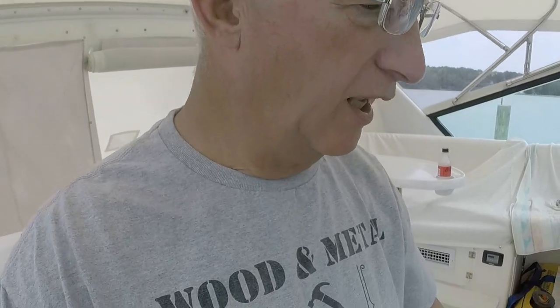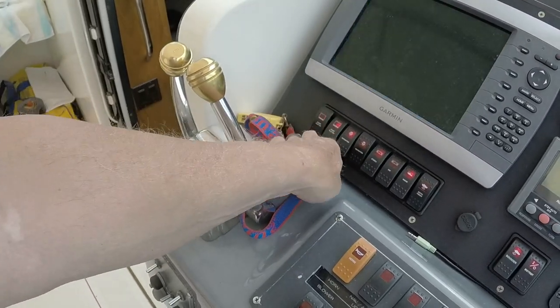The task right now is to go ahead and start working on installing the new XM radio cabling for the new receiver. So I'll have that all in place, so when I go to replace the MFDs, it'll be a quick switch out. I just unplug one, plug the other one in. I've got another device, a new heading sensor coming, and we'll install that when that comes, and that will get rid of the NMEA 0183 network requirement for the compass. All right, I'm going to turn all this stuff off, and we'll get to running the cables